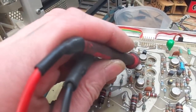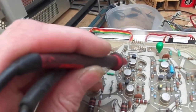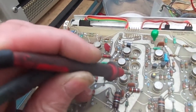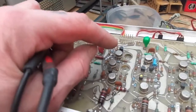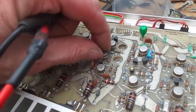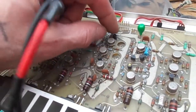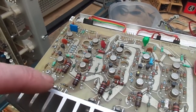I found the short between the base and collector on this dual package transistor. However, when you switch to ohms you get a reading of 82 ohms — and follow it down, there's an 82 ohm resistor. So that's alright. I thought these would be an absolute pig to unsolder if one were wrong, but actually they come in little sockets. They're all in sockets — that makes testing things much easier.